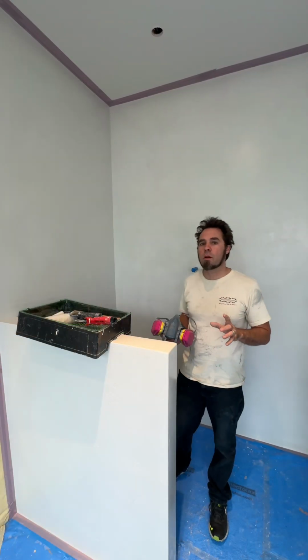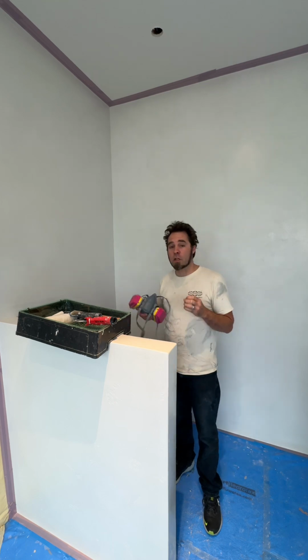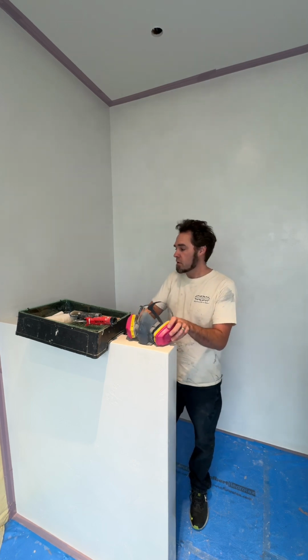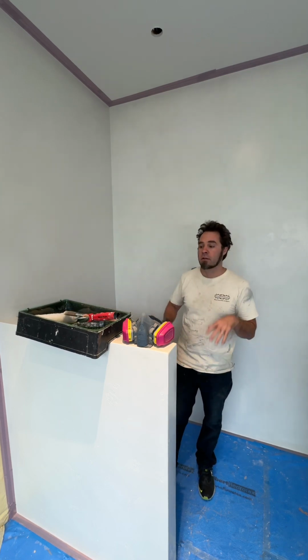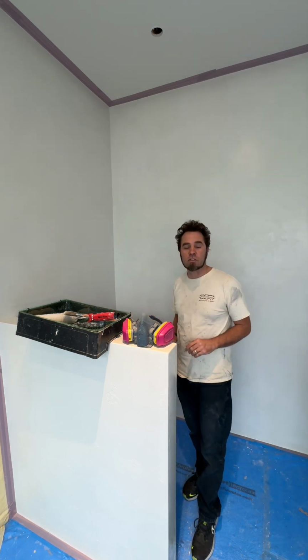You're probably wondering what kind of equipment you're going to need for when you're applying the PU20. Because this is a two-part sealer, you need to protect yourself. We traditionally do this application either at night or on the weekends when no other trades are around. This is a NIOSH-approved carbon filter mask. We've got our main roller, we've got our whiz roller, we have a brush, and a clean new tray liner or a clean new tray. That's what you need for the application of this, and you can use all of this throughout both coats because we're going to put a coat on, wait a few hours, put our second coat on, clean up, and then we're done. So when everybody shows up on Monday, it's clean and ready to go.